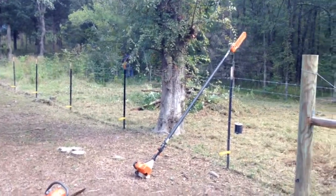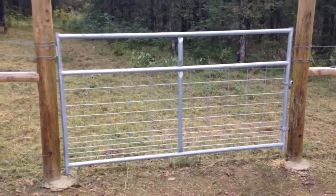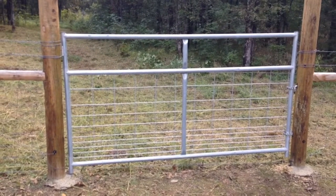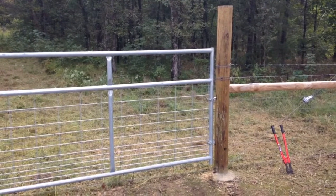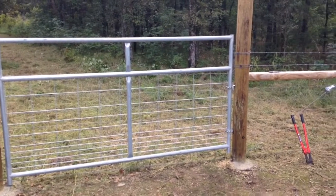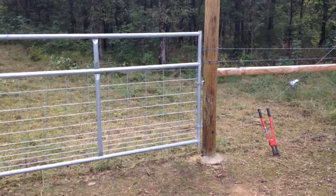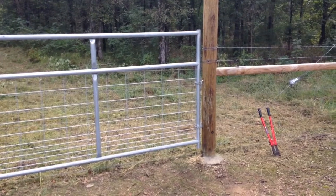The thing with these gates — it's critical that you do the best you can. I know it's hard on an unleveled surface, which we're on here, to get your gate as level as you can. It makes a nice presence even though this isn't a public area — it looks good from the driveway. Make sure to take your time and get your hinges in the right way. It really takes two people to do this to get it all leveled up and in there right.